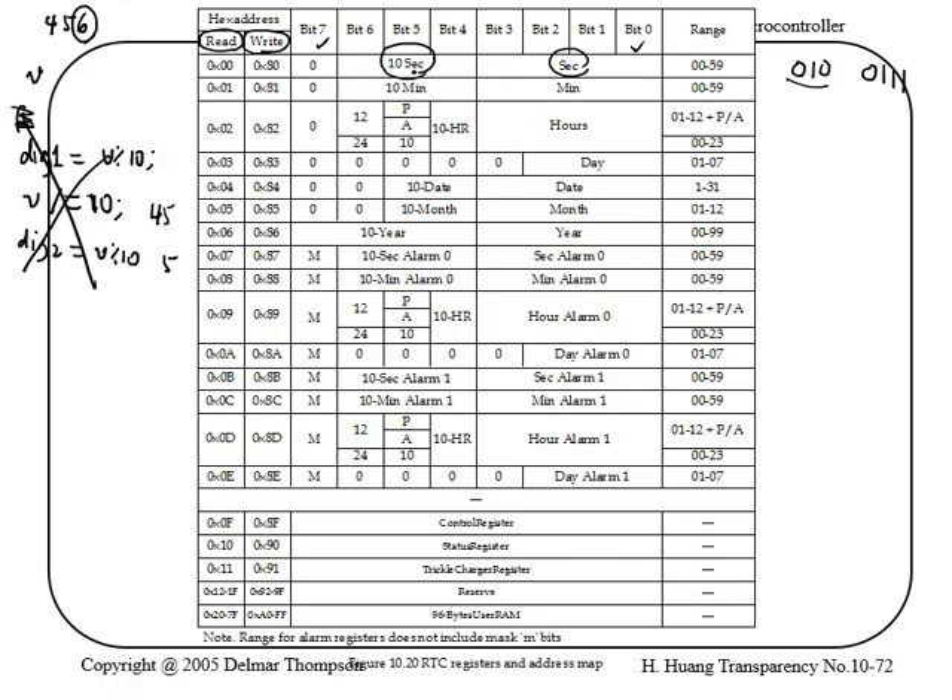With BCD you don't have to worry about the raw binary representation — the chip stores a BCD 23, not binary 00010111. The chip handles the BCD operations. By the way, you can do BCD in PIC too: there's the DC decimal carry bit, and the hardware automatically detects things like incrementing 29 in BCD — if 9 increments to A, the BCD adjust operation changes it to 30.